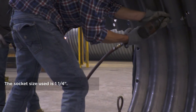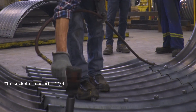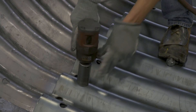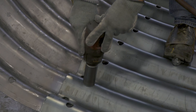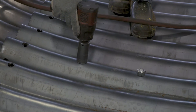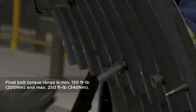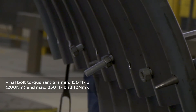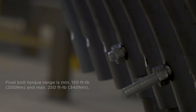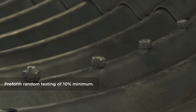For tightening the nuts, a one and one quarter inch diameter socket will be used on an impact gun. The size of the impact gun and air compressor will depend on the size of the structure and thickness of plate being assembled. The most efficient approach is to use a one inch drive impact gun with a minimum 180 CFM compressor — the type you tow behind a truck. Sometimes smaller equipment can be used, but it will take longer to tighten all the nuts. All the bolts need to be torqued to a minimum of 150 foot-pounds and a maximum of 250 foot-pounds. It's important not to over-torque the nuts. Once the structure is complete, a minimum of 10% of nuts should be checked to make sure the torque spec is met.